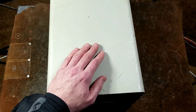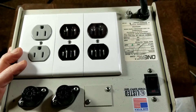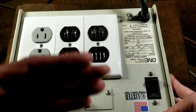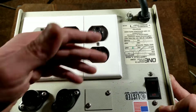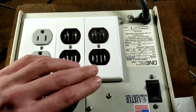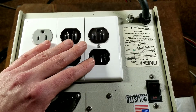It not only has the transformer — I'll show the backside — but it has what's known as avalanche diodes. Instead of metal oxide varistors, which are in pretty much all standard surge protection equipment, this uses avalanche diodes. Metal oxide varistors have to be set very high — 300, 330 volts, or even 400 to 500 volts is standard in many power strips. This unit will regulate within 10 volts and blocks anything above 200 volts.